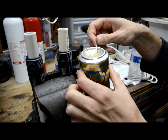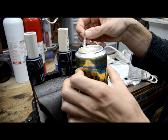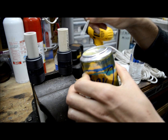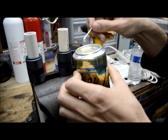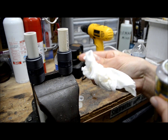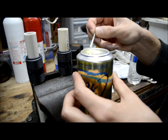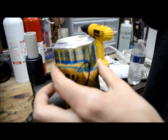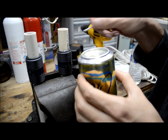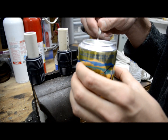I'm going to apply the epoxy very carefully to the outside of the pipe and it will fall down to the inside of the nipple — just take a little bit on your mixer, put it on the side like this, and let it fall down into the nipple. This is going to be really tedious but it's the only way to do it. If you get any epoxy on the threads, just wipe it off — this stuff doesn't harden fast so you have time. Keep putting it in there until it won't go in anymore, making sure you put it all around the nipple.